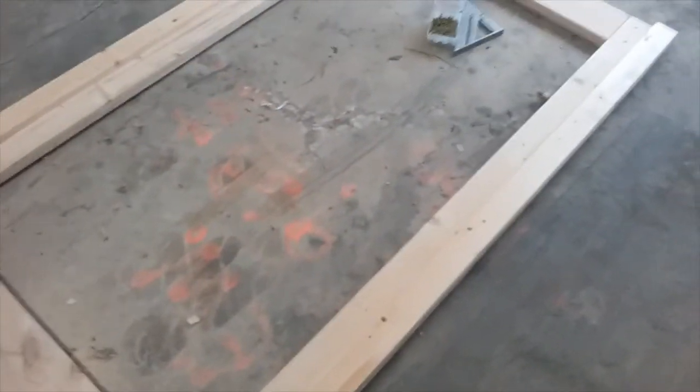Okay, we're going to put a slat every 12 inches, starting right here at the head. There'll be one here. You see where I got them laid out there? There's one, there's another, and there's another. On this particular bed, it's going to be 7 slats, and I'm going to use 1x4s for that.